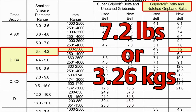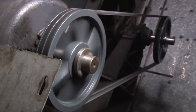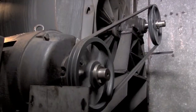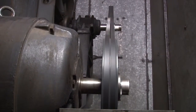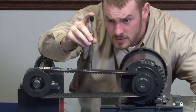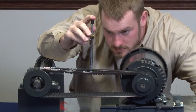Please keep in mind that tension is always changing. As the drive runs, as the belt seats, and as the belts wear into the groove of the sheave, you are going to see tension change. In an optimum situation, we recommend re-tensioning after 20 minutes, 24 hours, and again after 48 hours.